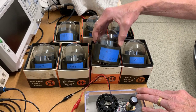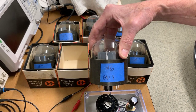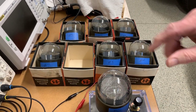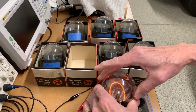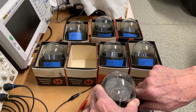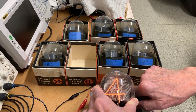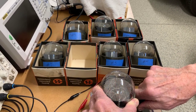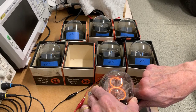Now tube number six has an issue — the numeral seven is not working. If you're making a Nixie clock, though, this could work for the tens indicator because you only need zero, one, and two. So that won't be an issue if that's what your application is going to be. Seven is broken, as you can see. Eight is not.